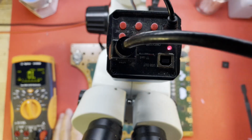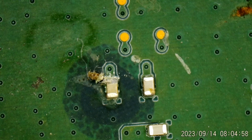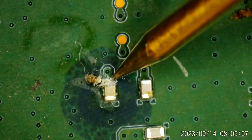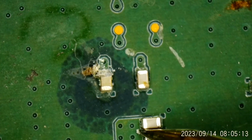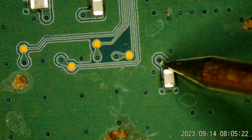We're going to look in the area of that Wi-Fi Bluetooth module. See, there's that capacitor I saw that has corroded away, but that does not seem to be shorted. Let me get my meter, still in continuity mode. Like if I check right there, I'm not getting a short. Or there. I do there. There, and this one right here. I don't know that those are on the same. That and that should read short.